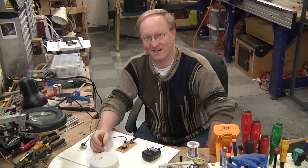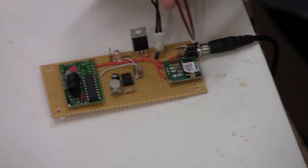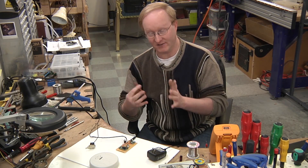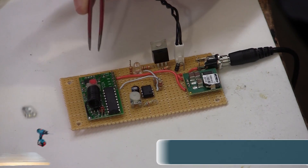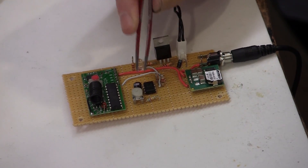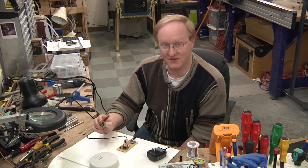I didn't have to build a miniature circuit this time which made it a lot easier. Here are the parts. This is your 24 volt wall wart — we need 24 volts for the solenoid; 12 won't cut it, 15 will do it, 24 is pretty common. Our 24 volts comes in here and goes into this switching voltage regulator, which is much more efficient than a linear 7805. The 7805 would work but the bigger the difference in voltage, the more heat it creates. This guy will work nice and cool. It's sending five volts to the 555 and the key fob detector. When it detects a signal from our dog collar it will trigger the 555 to do a 12 second one-shot, adjustable with this potentiometer. The 555 sends a high pulse for 12 seconds which activates the TIP 102 NPN Darlington transistor, allowing current to flow through the solenoid and unlatch the door so the dog can get in or out.